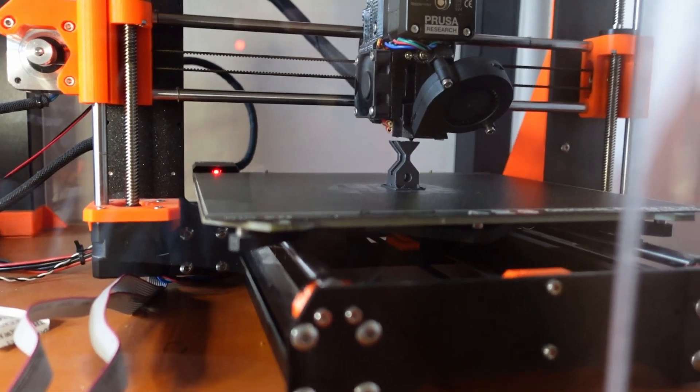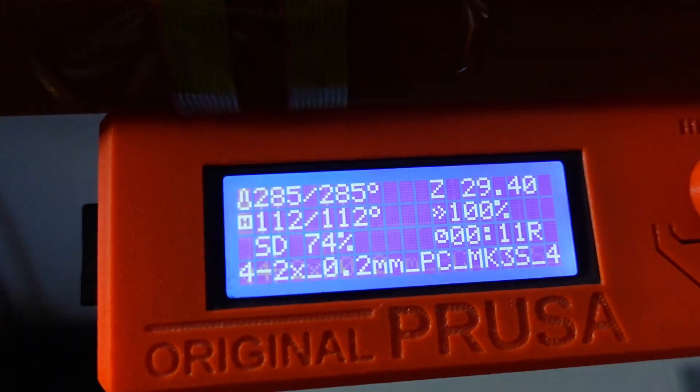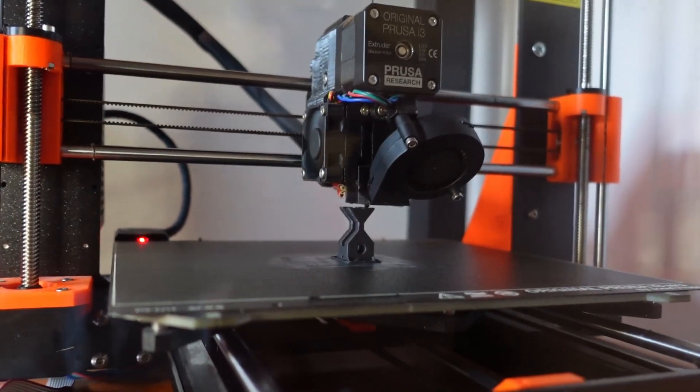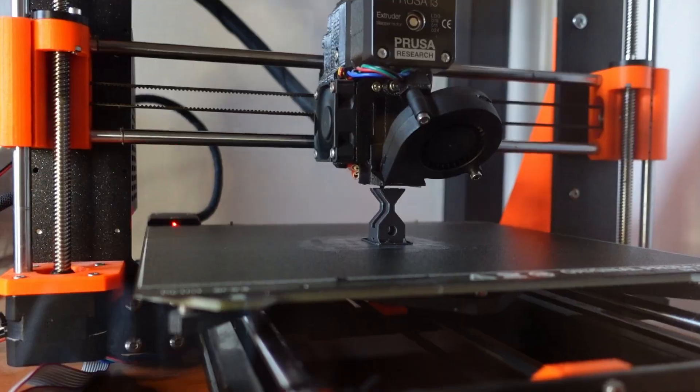In the meantime I checked the results and they were significantly higher, but I made the mistake of changing two significant things at once — I disabled the part cooling fan and raised the temperature by 10 degrees, printing everything on 295. So I decided to reprint everything, this time with the part cooling fan disabled but everything printed at 285 degrees Celsius.